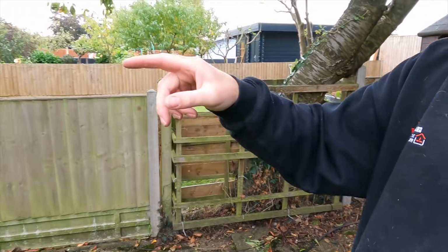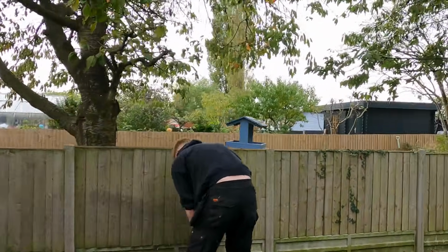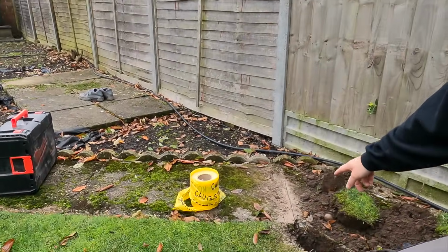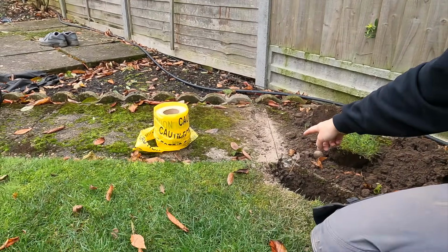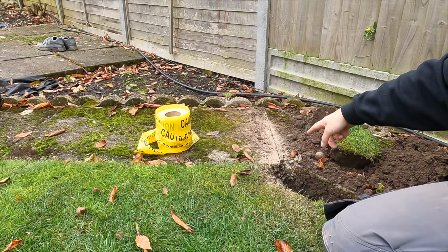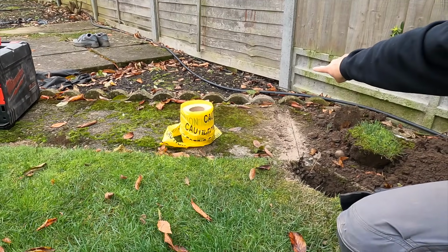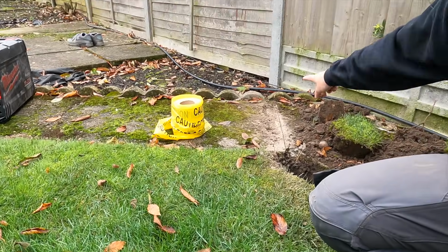So where we've got the concrete path up that bit, do you know what, I'm going to run up and show you. So where we've got the concrete path here, we've already cut our channel in. So we've got the channel in the floor, that we've just got to break it up. We're going to use our normal SDS and just chase that through, because it's not particularly thick. So we just do that, break it down, and then we're going to bring the armoured through that bit there, and then drop it down into the trench, and then we can reconcrete that bit.